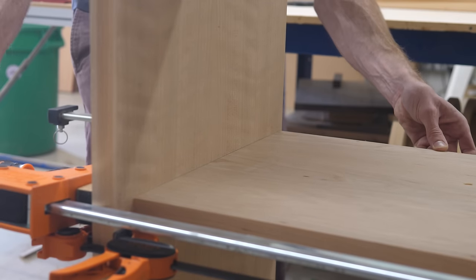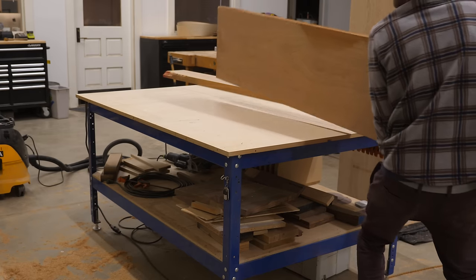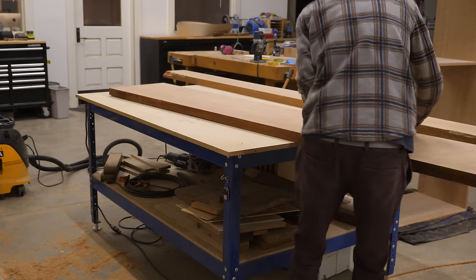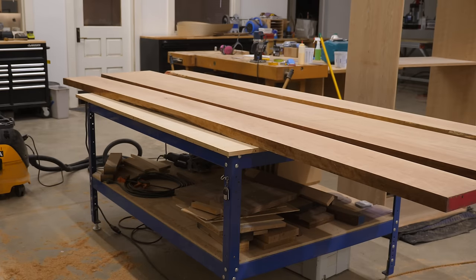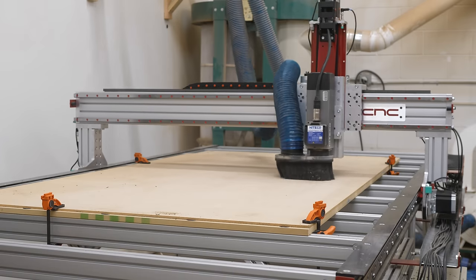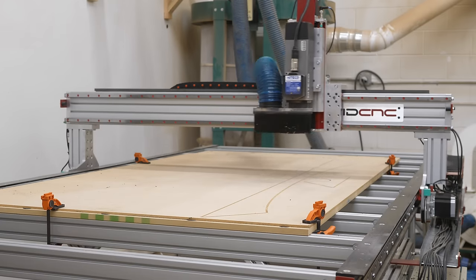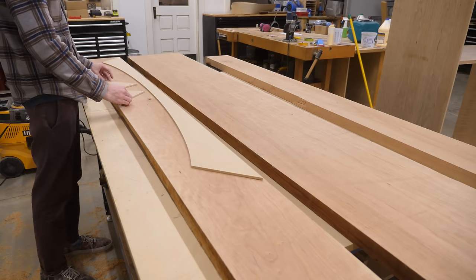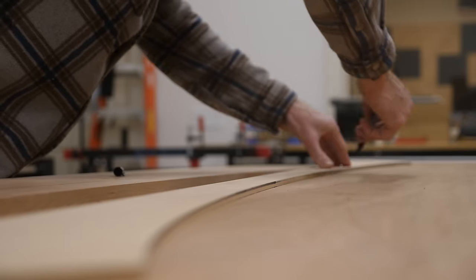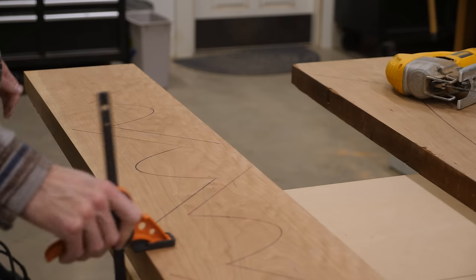How do you make a big plywood box look interesting? I think there are a lot of ways to do that, but a good start is to make some cool looking legs. Forget the plywood for a minute — let's make something out of solid wood. If I'm making big legs for a big cabinet, I'm going to need big templates, and to make big templates you need a big machine. With the templates cut out on said big machine, I could start tracing out and rough cutting all of the leg parts — two identical leg assemblies, each with four parts, two of which had a Batman vibe to them, which is pretty cool.